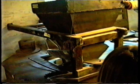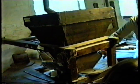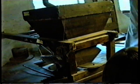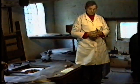Now, ground. This is the container, which we call the hopper, that holds it. This, where it sits on, is called the horse. And it usually has four legs, and this is sitting on it, so we call it a horse, because it's holding that. Here is a place where it goes down into the stones. It's at the bottom, so we call it the shoe. So you've got the hopper, the horse, the shoe. That's where the wheat goes down into the stone. It goes in there as far as the very bottom stone for you. It comes through from the centre, between the two stones, and comes to the outside. It goes in like this.